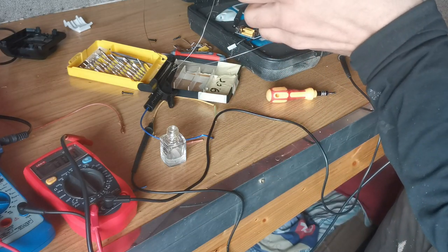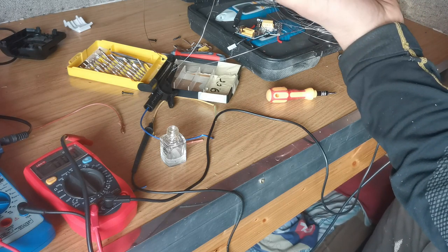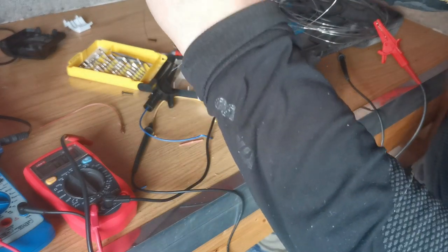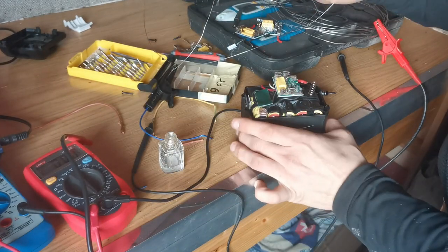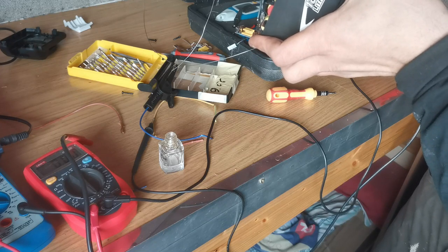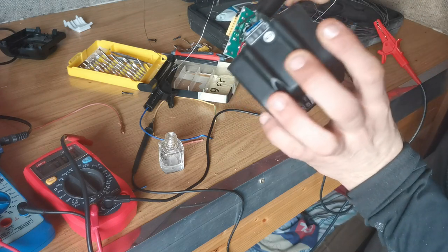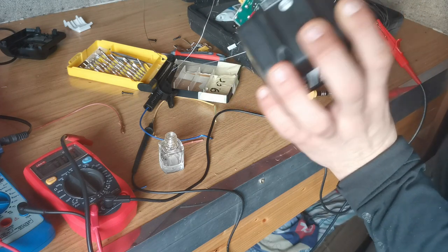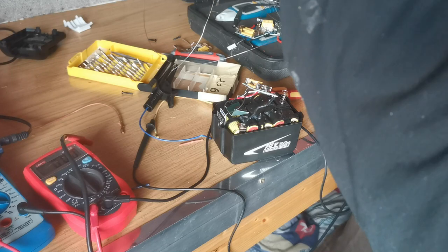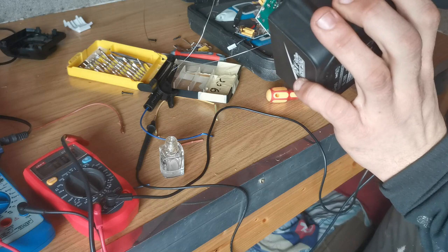It's important to get every chip on the board covered with clear. Why clear? Because clear nail polish doesn't conduct electricity. So this will give me a little bit more of a protection when I'm going to use this battery outside and inside and in wet conditions and not, so for me it's important.